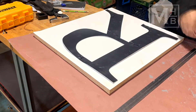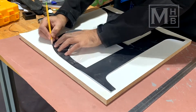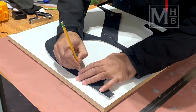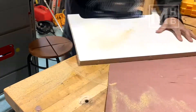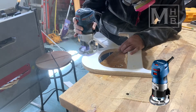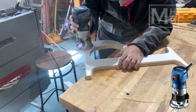I cut out the template using an exacto knife and taped it together onto a scrap piece of melamine I had laying around. I transferred this template to the melamine by tracing around it. Using a jigsaw and a fine tooth blade, I cut out the letter paying close attention to the corners. Once completed, I put a small round-over on the front of the letter using my trim router. This, along with a quick sanding, gave a clean look and smoothed out some of the imperfections left by the jigsaw.